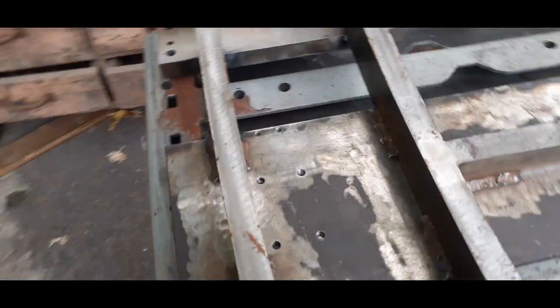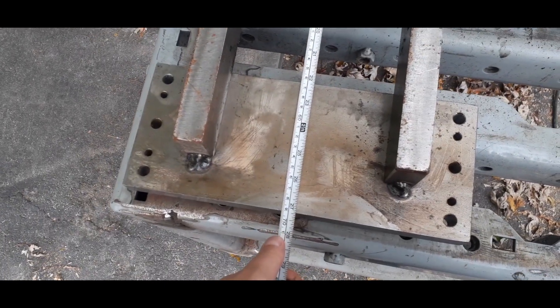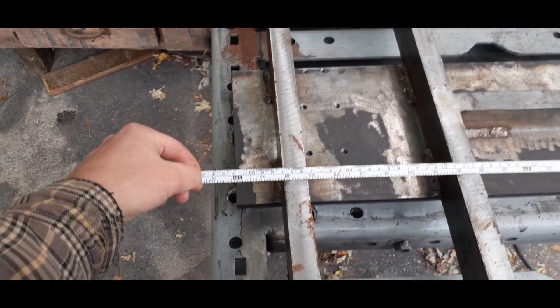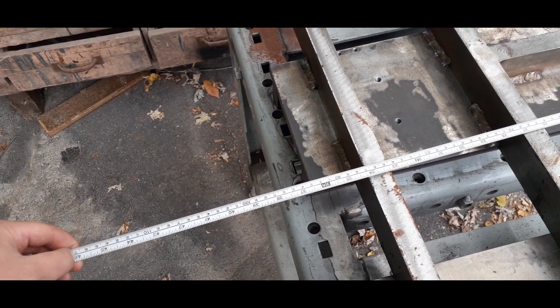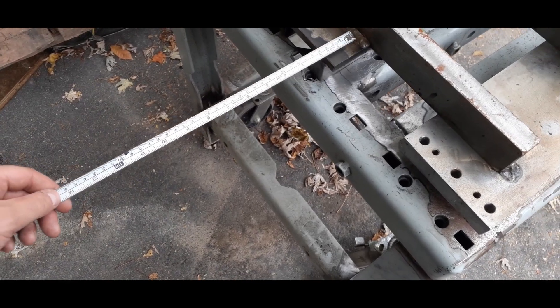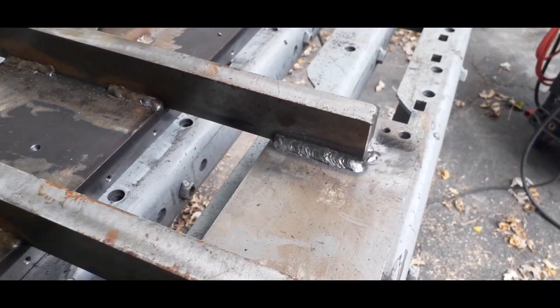The whole goal was to have this fit through a standard doorway, so the whole assembly is only 690 millimeters wide — 27 and a quarter inches — so it'll fit through pretty much every standard doorway in a household or garage. It's 36 inches long, 920 millimeters, and it'll be a bit longer because the cable chain for the Y-axis and the B-axis servo motor sticks out past the end of the frame by about 200 millimeters at minimum travel, so about 50 inches deep. But the length doesn't really matter that much — it's mostly just the width.